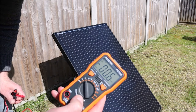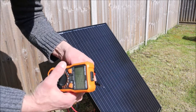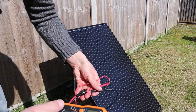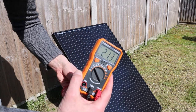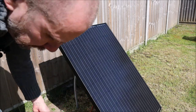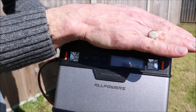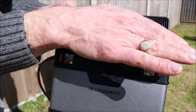It's time to check the voltage. I've got the trusty meter here just to see if we've got the same issue with the solar generator where the voltage is too high at startup. I've got to remember to connect this up the other way around, which seems counterintuitive — so red into black and black into red. In full sunlight we've got 21.3 volts. Let's plug that straight in just to double check. Again nothing happened. The startup voltage is too high — as you saw in the previous video, this battery seems to like somewhere between 19 and 20.5 volts to start.